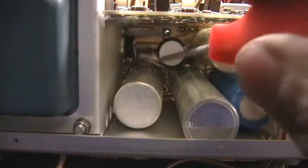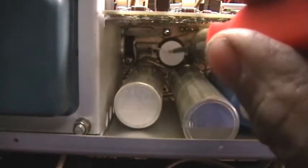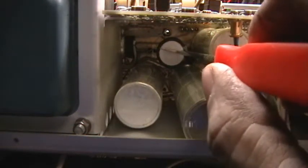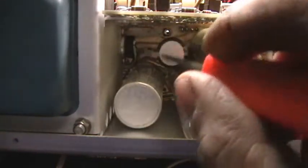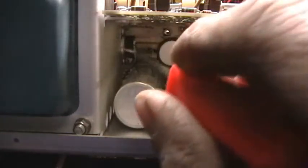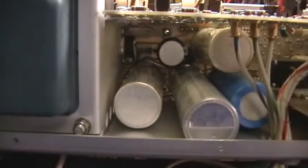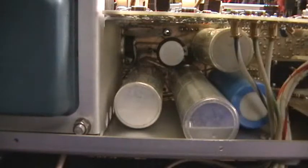One of the first things that was obvious was one of the capacitors which normally inhabited this spot - it was completely dead, completely open. So I removed it and replaced it with a normal modern computer grade capacitor stuck in there. But of course the PC board uses the metal can of the capacitors to complete ground connections between parts of the board. So when I put that in, I had to take and jumper over between the ground connections on the old capacitor holes there, to complete all the circuits that are needed. You'll see that when I flip it over.